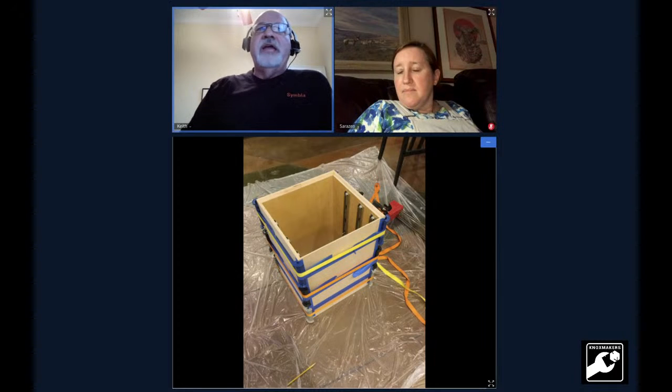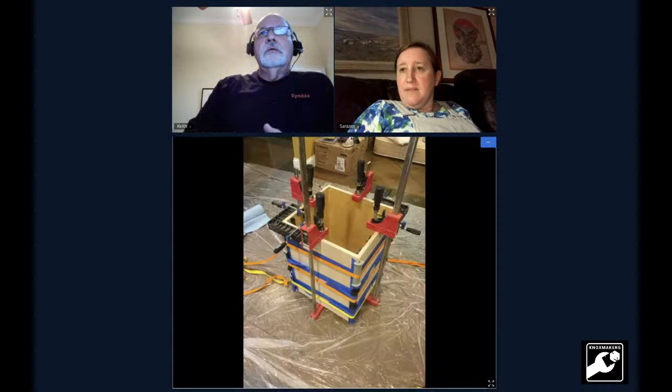It's just some band clamps trying to get things solid. I used the same sort of joint on the back side of it as well. You leave it overnight and it's solid. The measuring to keep it all square — having those miter lock joints helps to keep it square. So now I have a big box with some slides in there.